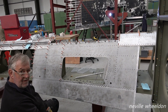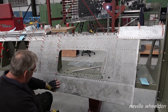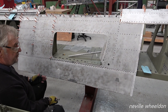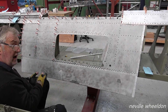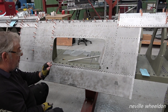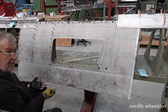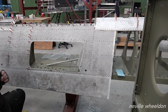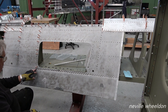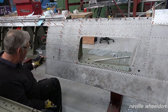Virtually you've got to start in the middle with something solid and then work outward. The problem is that you can't, like you would normally, pull it over and pin it up so it pulls itself — because the plug rivets don't go all the way through, they're only in a little bit. You've got the holes there and you can see they're out of alignment, but you can't do anything to pull them over because the holes are too shallow. It might be a case of pushing it over and putting some screws in to pull it over and hold it.